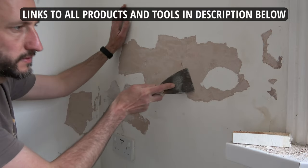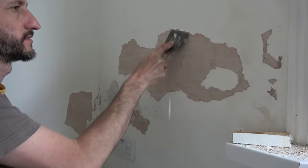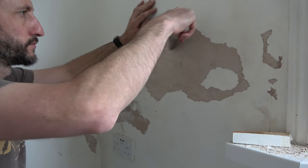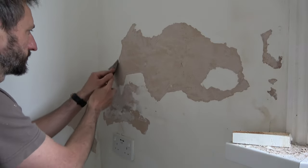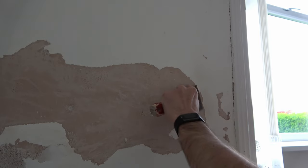The plan here is to remove any flaky paint. You don't want to go so hard that you're removing everything off the wall, but you want to ensure that anything that is loose and not adhering to the wall is removed. In your case you may have a really small patch and that's it, job done. Unfortunately with mine it seemed to be going on and on. If you get to the point that half your wall is in this state then it may be worth thinking about replastering the whole wall, but if you end up with a fairly small section like I did then it's well worth the hassle.